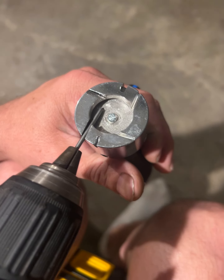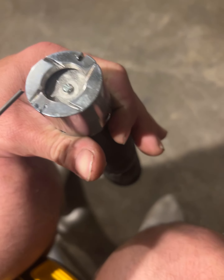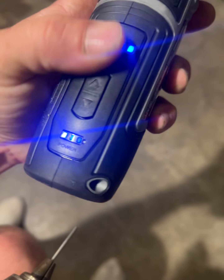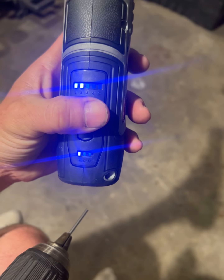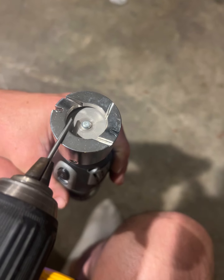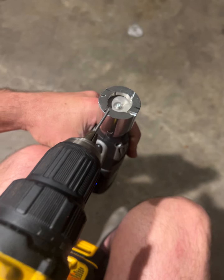You've got different grind angles — a grind angle is just the angle of the tungsten that AWS or whatever the standards recommend. You put it in there and crank this bad boy up just like this. This thing has different speeds if you want to crank it all the way up — that'll really get you there real quick. I left it on three. You stick your tungsten down in there, but you've got to have your drill spinning — that keeps you an even, nice grind all the way around. Makes you a nice sharp tungsten. Stick it right down in that angle and hold it nice and proper, get your drill spinning — nice sharp tungsten every time.